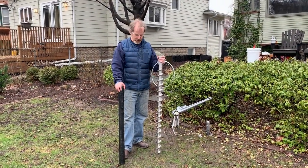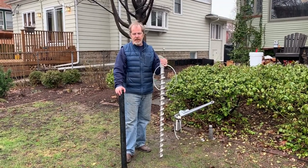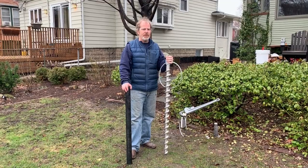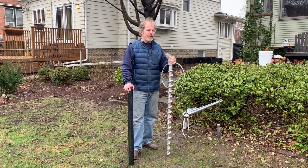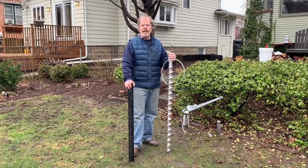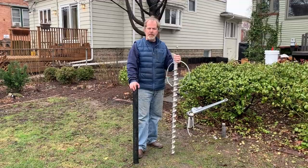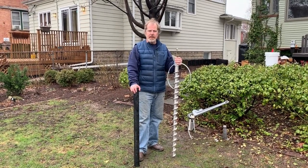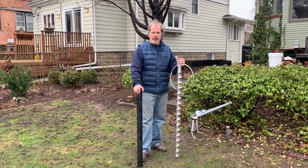In this installment, we're going to be exploring a contingency for the tracker sled. In the case that a tracker sled is exposed to extremely high winds, or in a situation where we're making a connection to a land-based inverter where we can't tolerate any movement whatsoever, it might be necessary to actually guy a tracker sled in place.